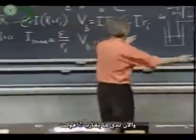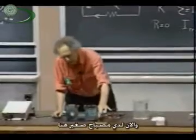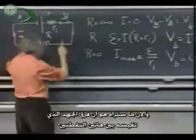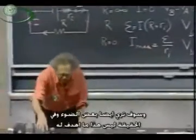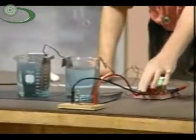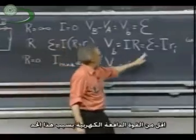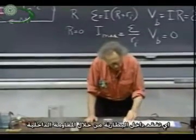So I have now about two volts between these two plates — two batteries in series. I now have a little light bulb here, and I'm going to turn it on. And now what you will see is that the voltage that you measure right here — you can only measure the voltage at the plates of the battery — will drop because of the internal resistance. You will see some light; for those of you sitting close, you can see the light bulb going to be lit. I can see the light bulb, a little bit of light. And notice that the voltage goes down. So this value V of B is now lower than the 1.9 volts because of this term — you lose inside the battery, through the internal resistance, that potential difference.